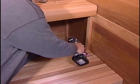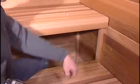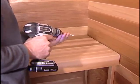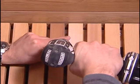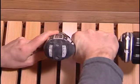Using a number 2 Phillips head bit extension, drive 2 to 3 of the 3-inch screws through the end of each bench to the wall. Place the screws at a 45-degree angle in the spaces between the 2x2 bench tops.